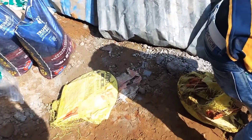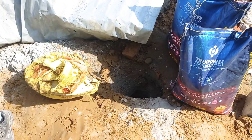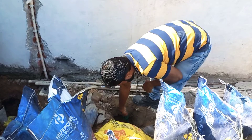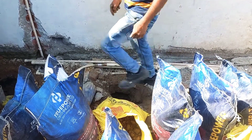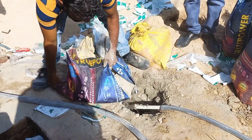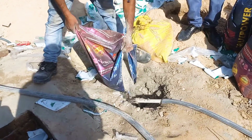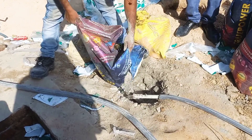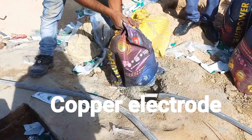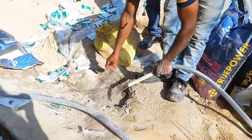Now we are at a different site — here you can see this is a copper electrode. We know that copper is a better conductor than GI. There are two types of electrodes mostly available in the market: one is GI type and the other is copper. In this particular project the customer has insisted on copper, so we are doing copper. Here you can see the complete process — chemical is being filled in these earth pits and water is being poured into it.